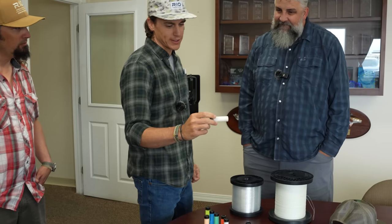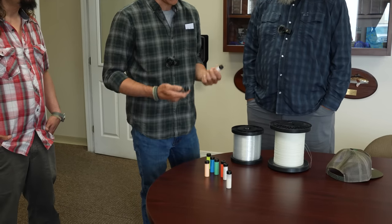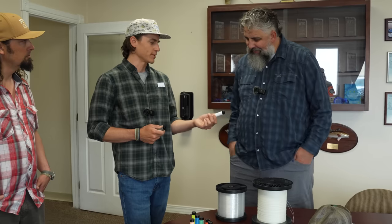So anyway, we got the plastisol here. This is hard to control the density of. There are other factors that we're trying to control with this, like hardness or softness and slickness, to make your fly line shoot nicely. So of course we add something else to it to either make it float or sink. This is a vial of micro balloons, which is what makes a fly line float.